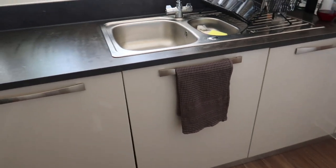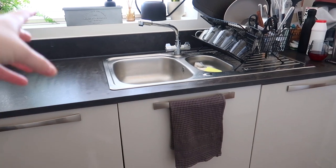It looks something like this and the tile will be up the back all the way along - nice and neat and tidy. We've also got the sink being changed, so once the backboards are off we can take the sink out, replace the sink and tap. The order is: rip off the backsplash and backboards, take the sink out, then do the vinyl - so I can get around the sink more easily and it looks more flush. The hob we're not taking out, so I'll have to work around it.